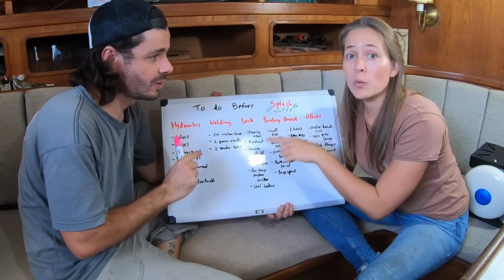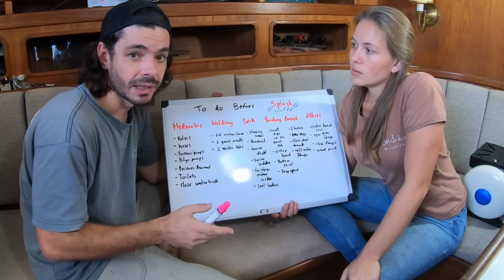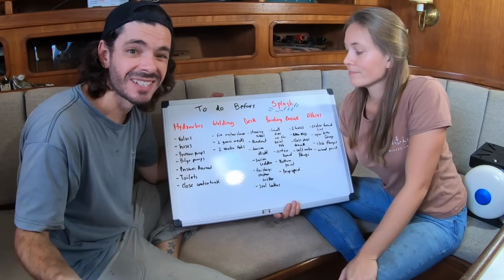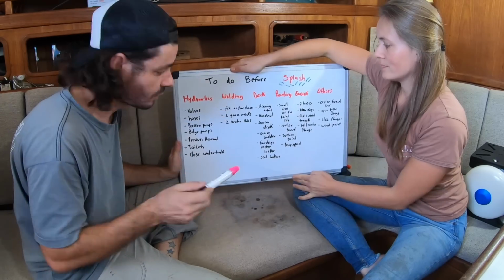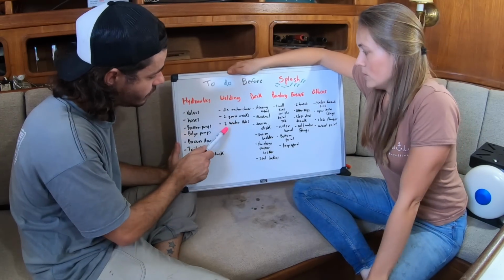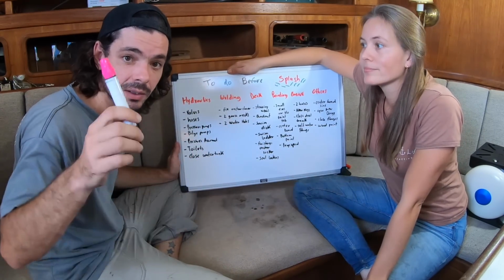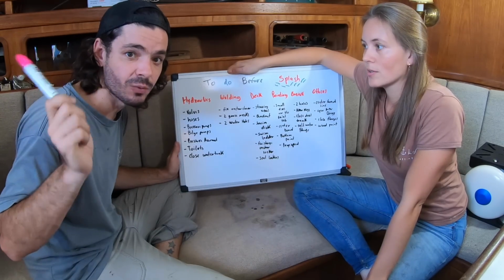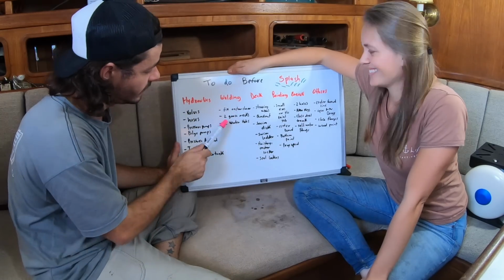but we need to do all the welds before we go to the water. It's possible to weld a metal boat in the water, but you get a much shorter life of the anodes, and as we replaced 13 anodes, we don't want to lose them, so we'd rather do all the welding outside of the water. So we have another 2 tubes that we need to weld to the hull to pass the water line through the hull, so we're gonna have salt water and fresh water on the stern and on the bow, so we need to do that.